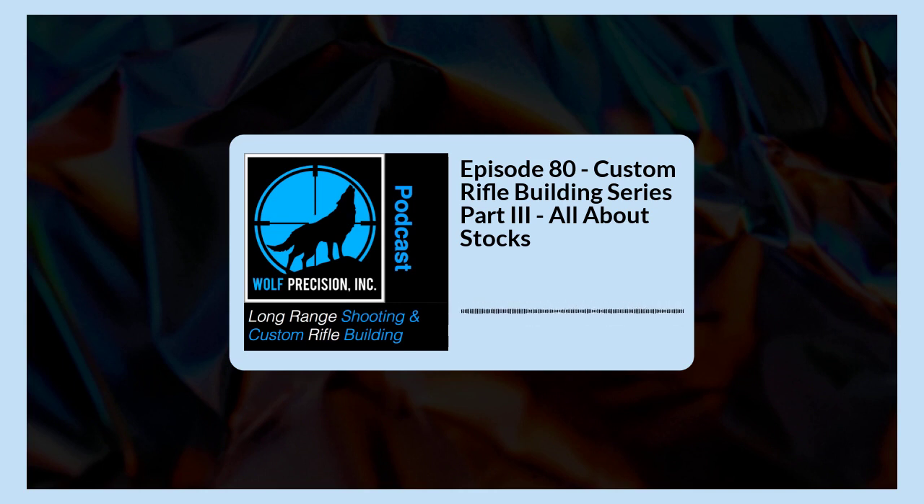Fast forward and you started to see the evolution of the stock turn into fiberglass — stocks molded such as the McMillan. When they came on the scene, they made some military stocks and revolutionized what stocks could do. One really important step when stocks took that next big leap was that the materials being used were inert or dead material — they didn't expand or contract in hot and cold, they didn't hold moisture. We're talking about 30 years ago that this step started taking place.